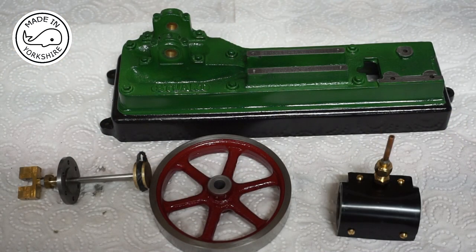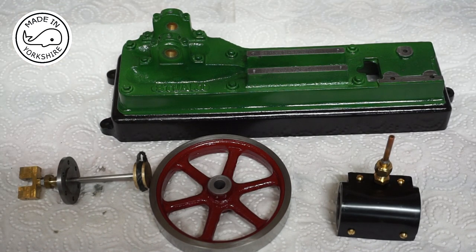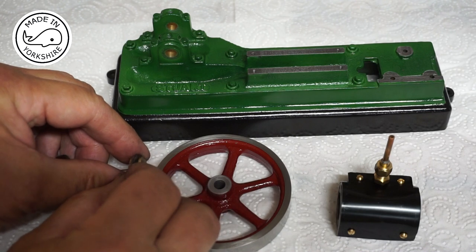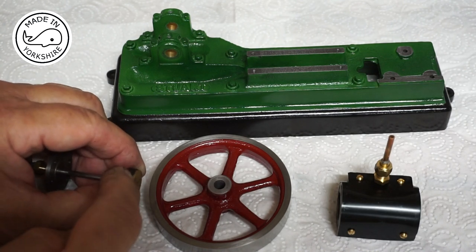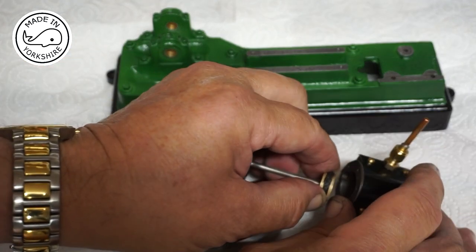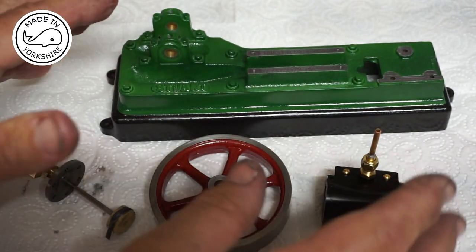The painting seems to have turned out okay. I put masking tape around the green and spray painted the black base, and it worked out pretty well. The next step is to get this graphite yarn into the piston groove. I've put some WD-40 on it — I might use a slightly heavier oil. Then it's a matter of fiddling around and trying to get it into the cylinder. I'll do that off camera and then I'll be able to start assembling.